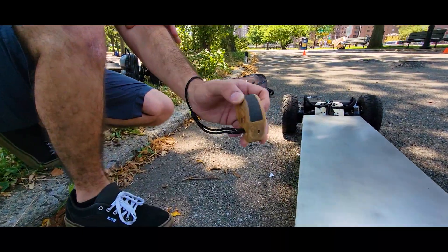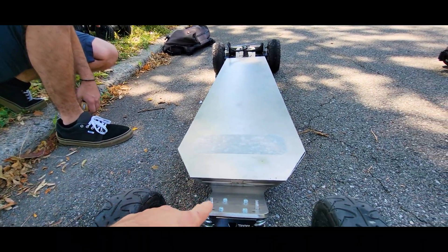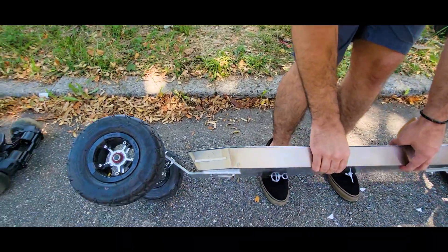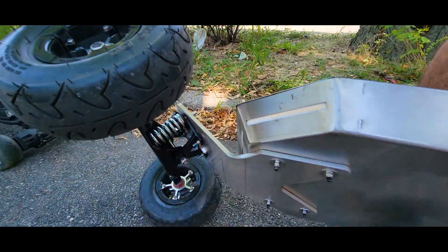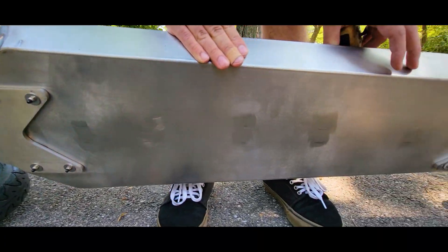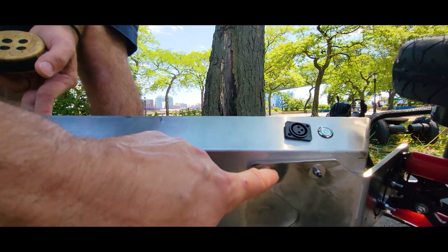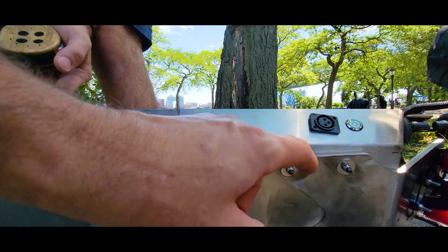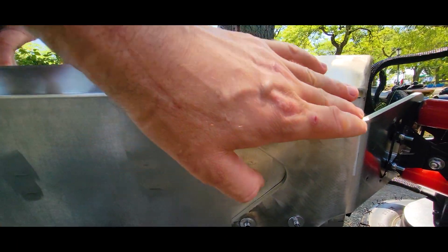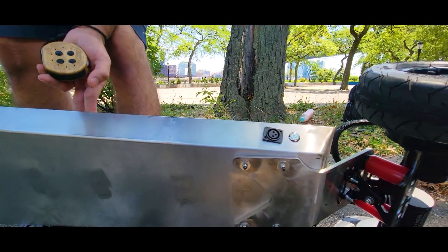It's got a white puck. We're thinking to put a 3D printed cover here so it looks nice. Look at the bottom — all this is machined. It'll be nice to cover the screws, cut them short, and make them flush. I have to put this one this way because the tops are rounded and I don't want sharp things inside for the battery to hit.